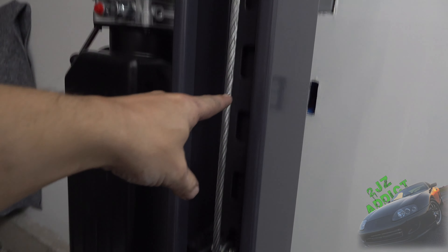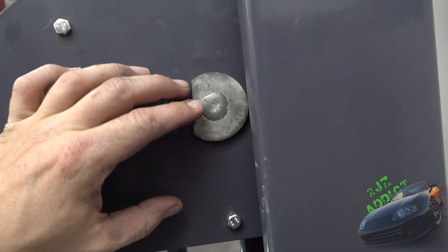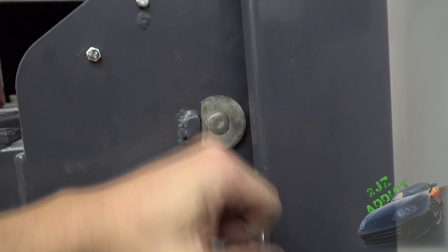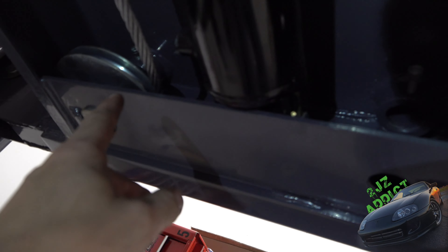So far this lift install has been super easy. Some big pieces take some finagling but everything else is simple — bolts right together. As for the cables, I went ahead and attached the forward cable up top first, then ran it down on the other side of the slack safety. I did need to pull out the roller guide and also the pulley. To do that you remove the e-clip, tap the pin out a little bit, rotate it 180 degrees, and it slides the rest of the way out. Run your cable, wrap it around the pulley, stuff it back up, punch the pin back in, and put the roller guide back on.